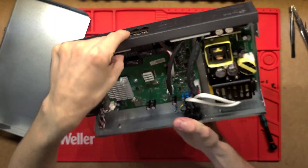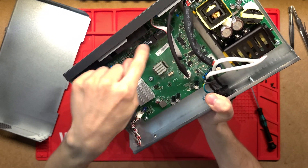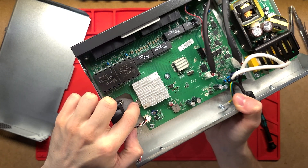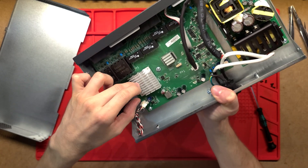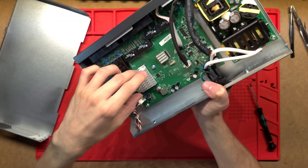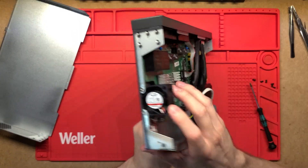Underneath here we've got that microprocessor doing all the processing and signal switching, and this other chip handling the actual switching and conversion. These two components here are crystal oscillators - literally a small piece of crystal that, when voltage is applied, vibrates at a very precise frequency. The microcontroller uses that as its clock, so all these components can function precisely on the same clock, which is important because everything needs to be well synchronized.